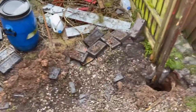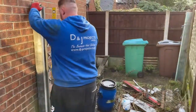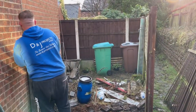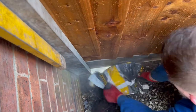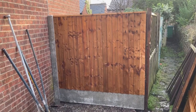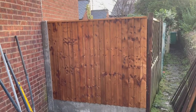We're going to drop that post in and then we'll see how deep our hole is. We're going to put a gravel board and a panel up against it, maybe backfill a bit if we have to, to get it level. Once we've got our gravel board and our panel we'll know how high that post needs to go. Gravel board in, post sitting lovely and flush, sitting lovely and level. That's the first bay up and ready.